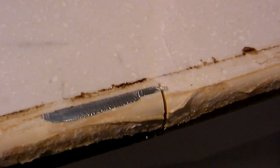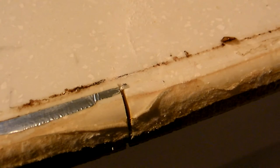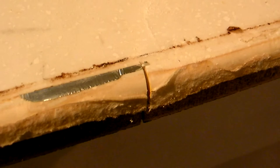Here's a little test cut that I did with the jigsaw. I'm using a medium-fine blade and it left a very, very clean cut, which is encouraging — I'm very happy to see that. What I'm going to do now is check the blade depth because I think my blade might be too short. This is quite a thick counter and I don't want the tip of the blade skipping out and hitting the countertop, which would chip it really badly. So that's the next thing to test.